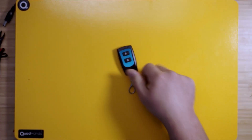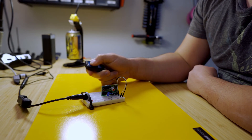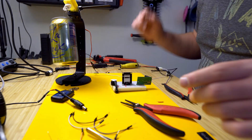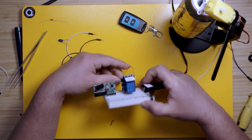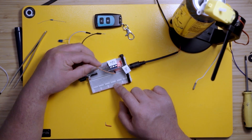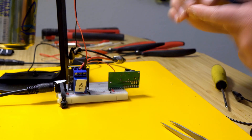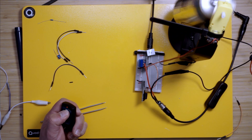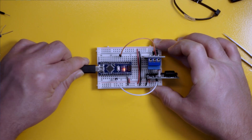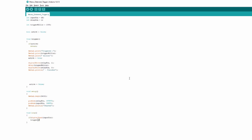To control it from a distance I got this remote and receiver from Adafruit. It took me a little while to figure out how to make it work but it turned out I was just using the wrong pin. I tried connecting the controller directly to a relay so when I click the remote it turns on the relay and connects the motor to 12 volts, but this didn't work as I hoped. The problem is that the controller sends little pulses instead of a steady current, so the motor turns on in little sputters. I solved that by using an Arduino mini and writing a super simple program that detects the pulse from the remote and turns on the relay for a predefined amount of time.